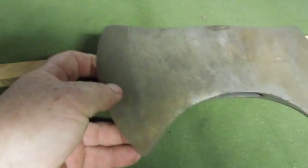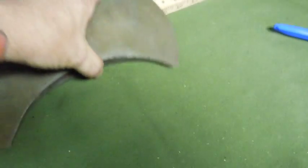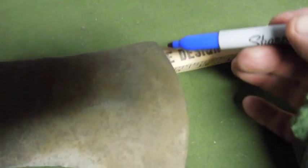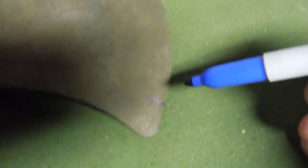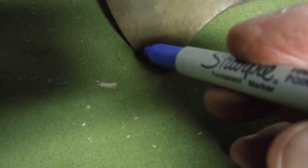There's no damage or nicks to the edges. There's a unique little strangeness going on with the edge that I can fix with no problem, but I've just never seen it before. If you look at this arc right here, it goes all the way around to that point right there, and then the arc quits and this ear follows a different arc. I thought some guy just slipped when he was sharpening, but the same thing is happening over here. So I've never really seen that before, but it looks intentional. I don't sharpen my axes that way, but I'll straighten that up when I do the edge.